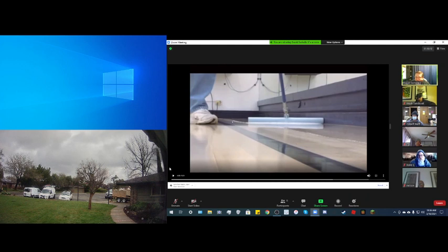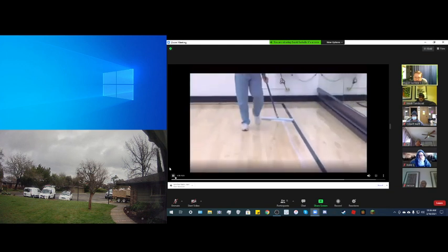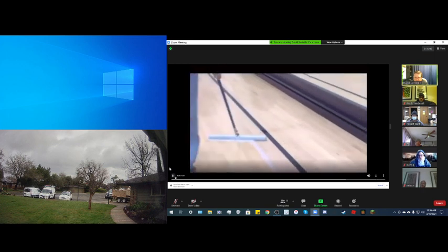You'll notice it leaves what we call a wet edge, where they're almost squeegeeing off the excess and leaving a bead or stream behind on this outer edge that they'll pick up as they go each pass over the floor. As Dave begins to lay down the gym finish using the Certex T-bar applicator, notice he has total control at his fingertips. Because of this control, Dave is able to maintain a wet edge, eliminating any possible lap marks caused by the edge drying too fast.